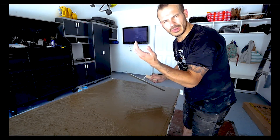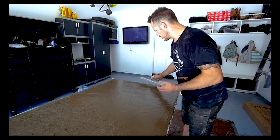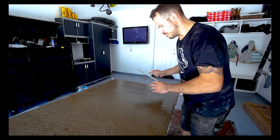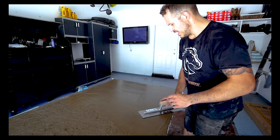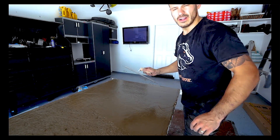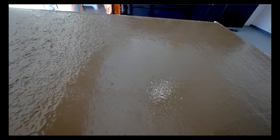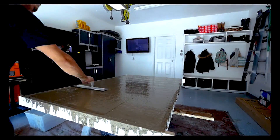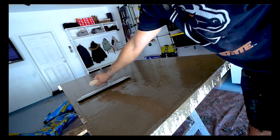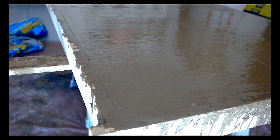As all the fluid rises up, the little voids are being filled in and the air bubbles are coming out. I'm using a float — a finishing trowel — and just allowing it to glide on the moisture. If you dip it too much, it will pull some rocks out, so just be gentle and float it to create a smooth surface and get rid of the water coming out. Once you've done all the work you can to get air bubbles out and finish the top, leave it alone for three days to let the concrete cure. The best thing you can do is put a plastic bag or tarp over the slab to help it cure evenly — it releases and reabsorbs moisture to hydrate and condition the slab.